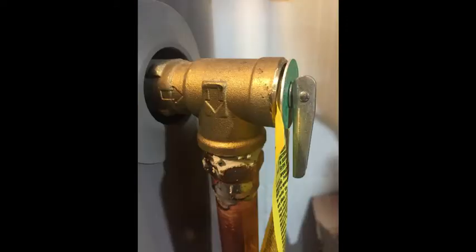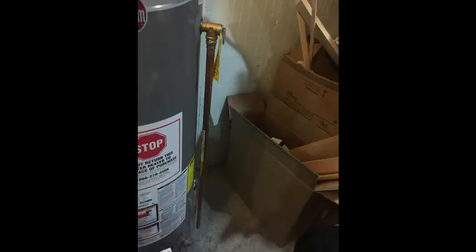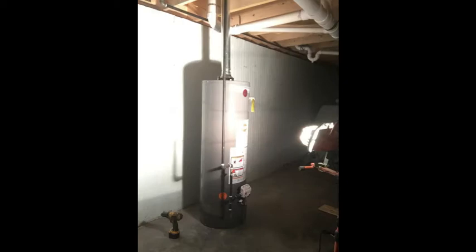You will take out your blowtorch and your solder and your flux. You're now going to have to solder a 3/4 inch copper tube about 4 feet long into the 3/4 inch threaded coupling of your hot water tank. This actually is your relief valve. If there's ever a problem with the hot water tank building pressure, it will allow hot water to spew out through this. If you don't put this copper tubing on and face it towards the ground, it'll blow out the side of the hot water tank and could go all over the place. So it's just kind of a safety precaution.